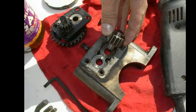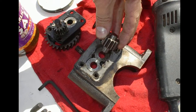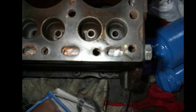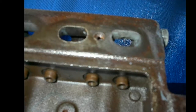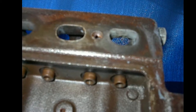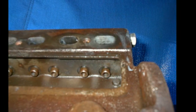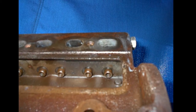This is the oil pump. Being bathed in oil, it didn't show any abnormal signs of wear — nothing I could detect. Here's the head cleaned up with all those cooling passages and stud holes showing. This is important because you can find things like a rotted-through block, which is very bad, or cooling passages that should be there but are hidden by gunk and buildup.